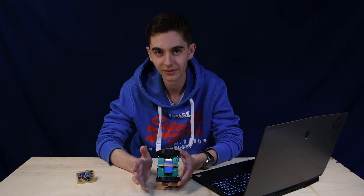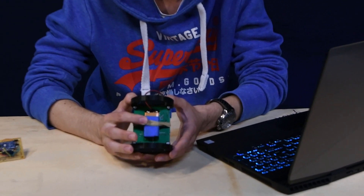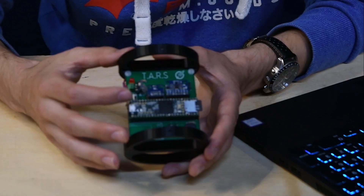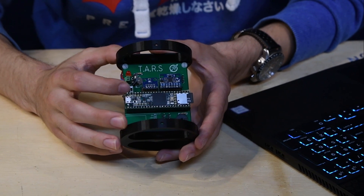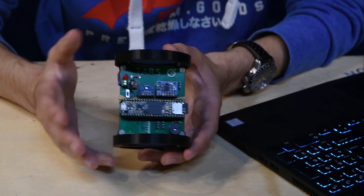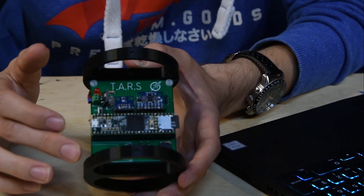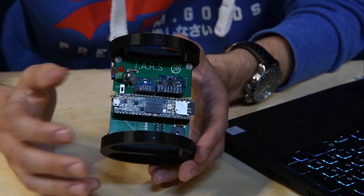We're going to run you guys over all of the components that go into the flight computer. Right here is our power source, which is a 9-volt battery. That heads into our terminal block, which has basically all the dead man switch — nothing is powered on until this switch gets flipped. That switch then adds continuity to our voltage regulator, which is this breakout board right here containing a standard voltage regulator. It regulates voltage from 9 volts down to 5 volts throughout the entire system — the Teensy takes a 5-volt input, the BMP takes a 5-volt input, and the IMU takes a 5-volt input.